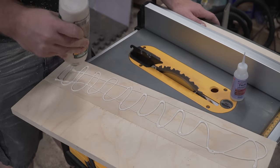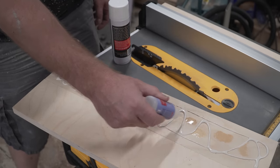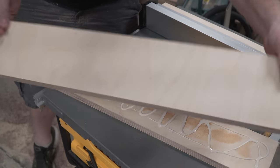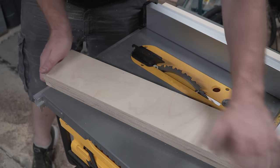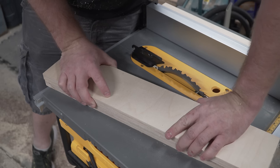You'll start by running a bead of wood glue across the surface of one piece. Then go back through and add several drops of superglue in areas where the wood glue didn't spread. On the other piece of plywood, give it a spritz of accelerator so the superglue cures instantly. Wait five seconds, and you have a laminated inch-and-a-half thick dead flat fence with no brad nails or anything to worry about cutting through. All the products I'm using in this project are available at the links in the description.